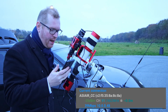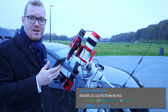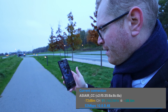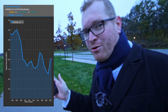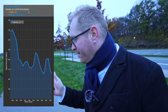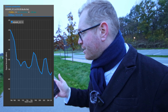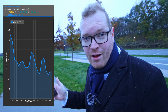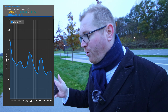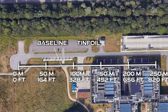We are connected again. I'm sitting at around minus 30 to minus 35, hovering around that area — not actually as good as with the stock antenna, but maybe it just lasts better for range. Let's go for a walk again. Minus 75 — it's bouncing all over the place again. So we are back to that very erratic, very unstable signal. Minus 70 is where we're definitely going to begin to see some dropouts in signal, especially if you're trying to transfer pictures over to your phone. So I'm going to call this a fail — this is actually performing worse than it did with the stock antenna. And so far, tinfoil has been the best solution.